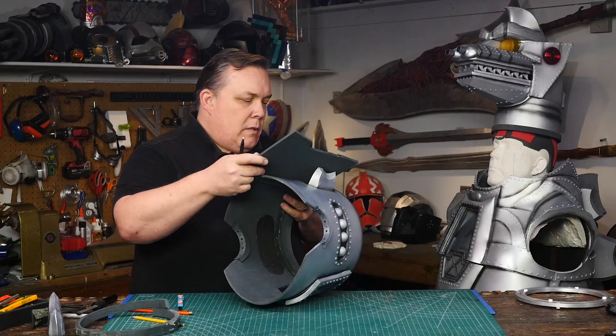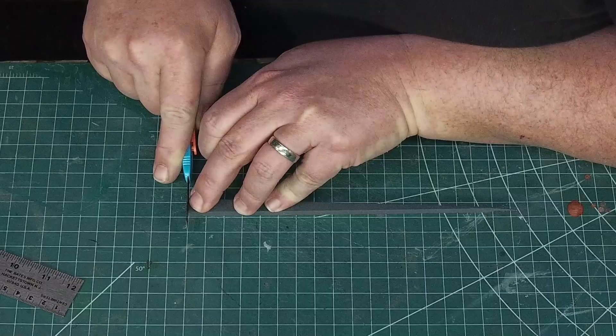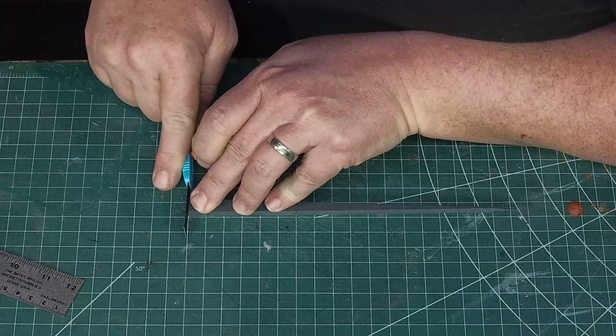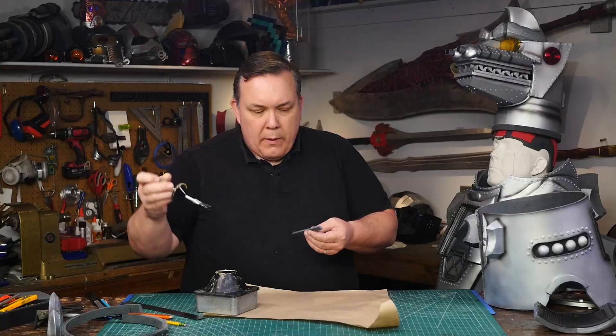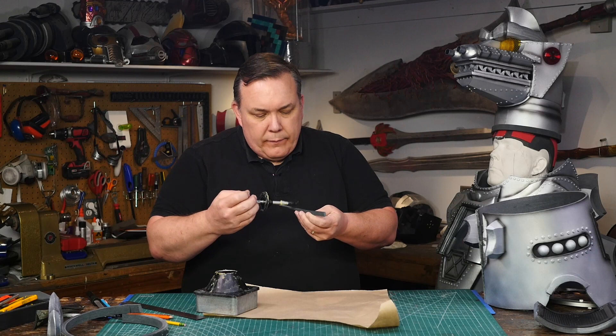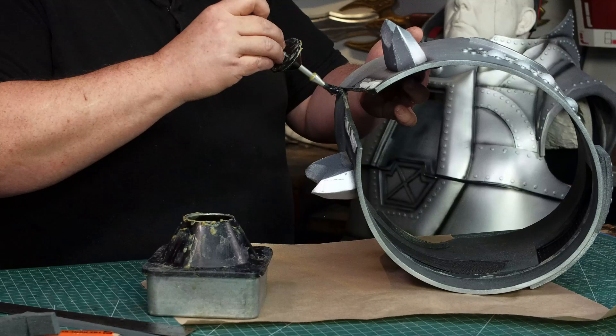While holding the foam shut, I can see what I need to make. I simply mark some foam for the length that I need and cut a wedge that is 13 millimeters at the widest. I also try to square off the top — I probably should have made this cut after it was all glued in. A quick test fit before I commit to glue, and on goes the contact cement. For all of these neck seams and repairs, I'm going to use two coats of contact cement. The second coat really does grip better than just a single layer of cement. I just need to be careful not to drip any onto the painted parts because it'll ruin the paint.